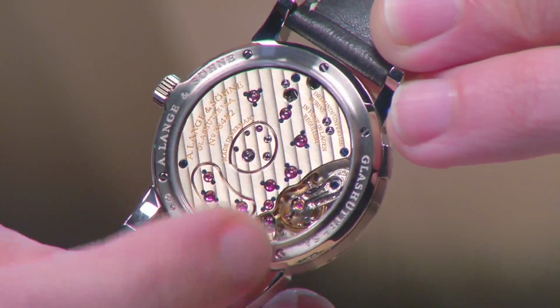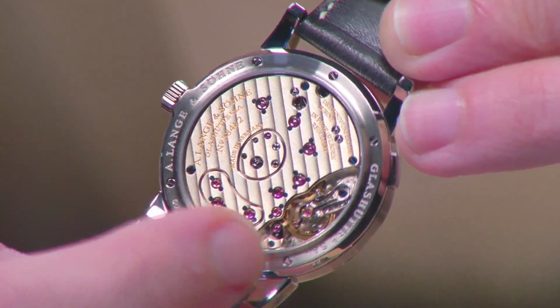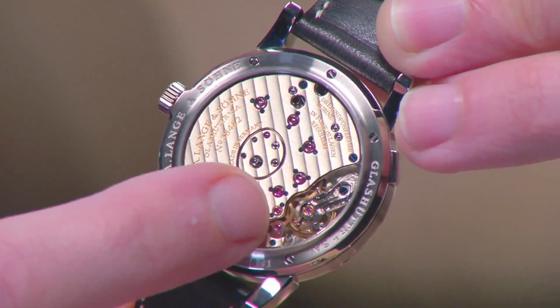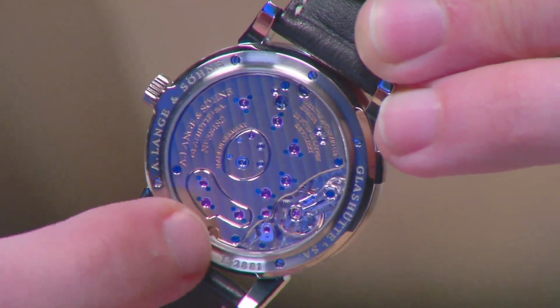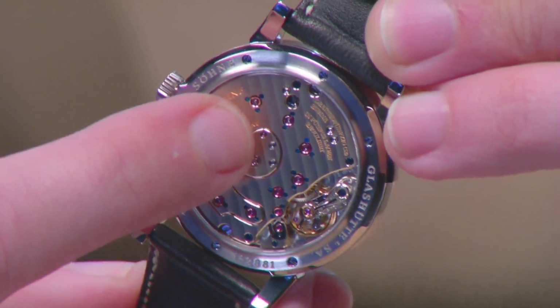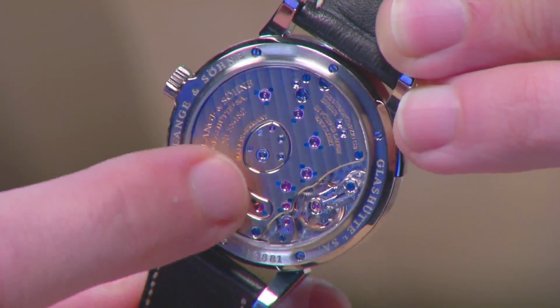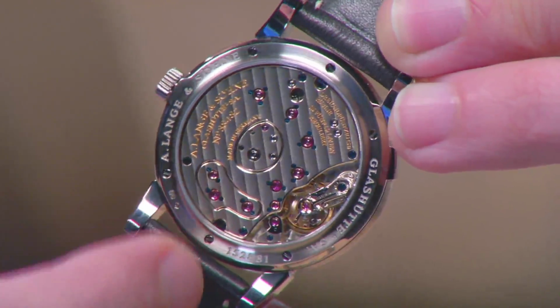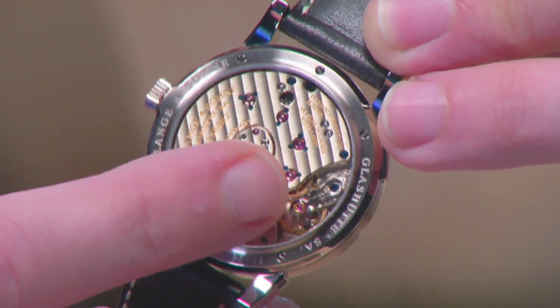watches, including the jewels set in chaton, and you can see everything from the barrel down to the train jewels are actually fixed to the bridges using screws rather than press fit. This is an old pocket watch construction method, but look closely and you'll see modern finishing standards, including a mirrored beveling or anglage chamfer around the edges of the access ports, as well as the edge of the half bridge and the three-quarter bridge.